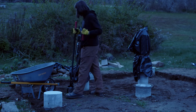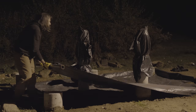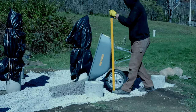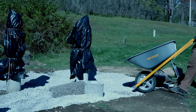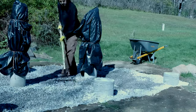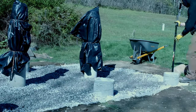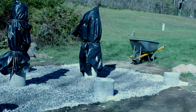The next step was removing all the organic matter from the footprint of the building, then putting down black plastic and replacing that soil with crushed stone. As architect Timothy Emerson said in my video with him, the purpose of this step is mostly to stop the ground below the structure from holding moisture and moving that moisture up into your building. Also, animals and critters aren't going to want to burrow into crushed stone, so it makes it less hospitable for them to come under your building and wreak havoc there.